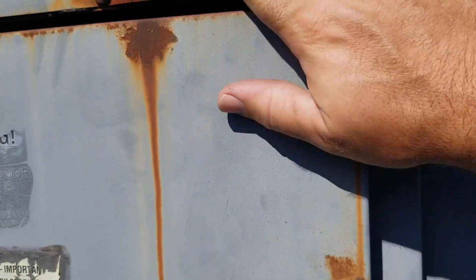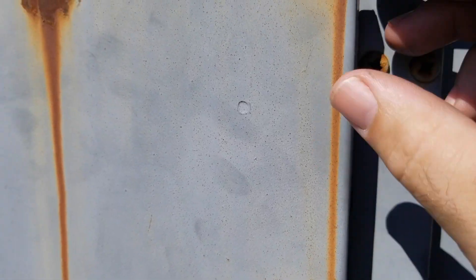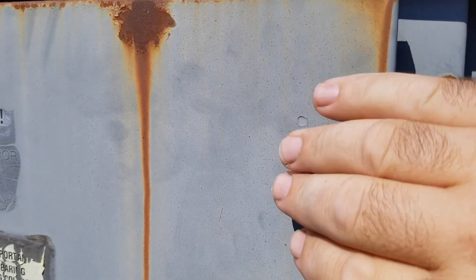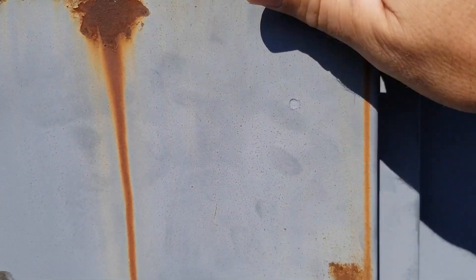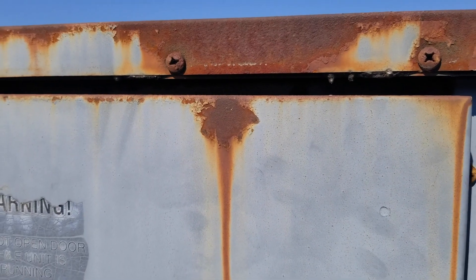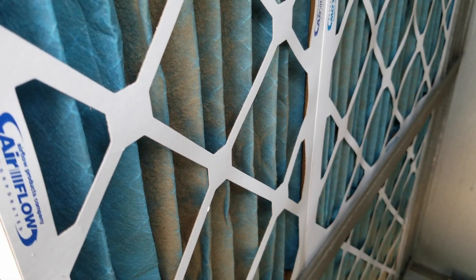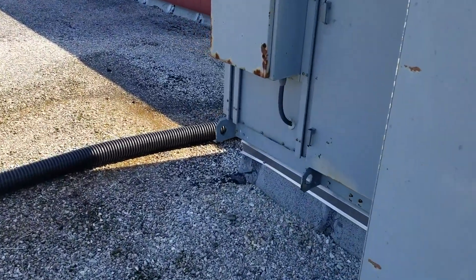You can hear air coming in around this door — a lot of air getting sucked in. It whistles a little bit, and if it's pulling that much air in, because the roof of the unit is sloped this way, all the rainwater is going to run down and dribble in here. If it's pulling in a lot of air there, it's potentially sucking in water too. Could it be that the filters are dirty and clogged and not flowing enough, so it's just trying to suck in air through all the seams? The fan is on the other side of the filters, and that other side is where the corner drip is located.